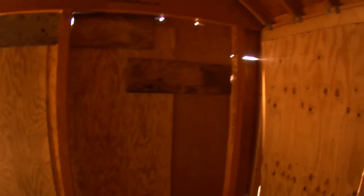Pretty much the entire front is now sheeted with three-quarter-inch and some Texture 111 pieces we didn't need to cut off. At the very last minute we'll take a sawzall and cut out any extra sheeting, then cover it up. We've put some double 2x4s up here for window support. Upstairs, we've done a double 2x8 header that will allow us to put pine board on top and cover it up.